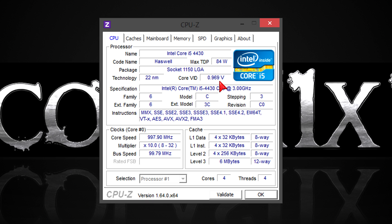With the C6-C7 states, the minimum current is 0.05A instead of 0.5A on Ivy Bridge and Sandy Bridge CPUs. However, lots of power supplies will not be able to support this new power saving feature without switching themselves off. Most power supply manufacturers now label their models whether they support the new C6-C7 power states or not. If your power supply does not support this feature, you can simply disable it in the BIOS. The Haswell processors also come with new instructions such as AVX2 and FMA3. Because of the C6-C7 states, the CPU can run at 0.8GHz on idle, down from 1.6GHz on the i5-3450 or 3330.